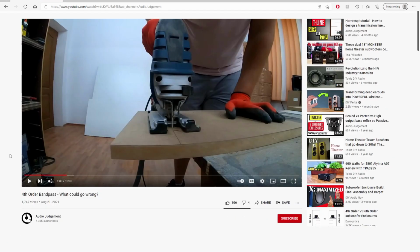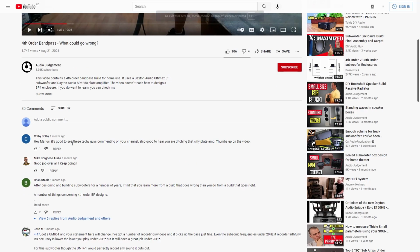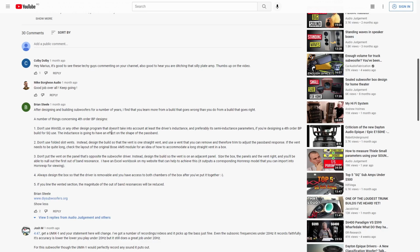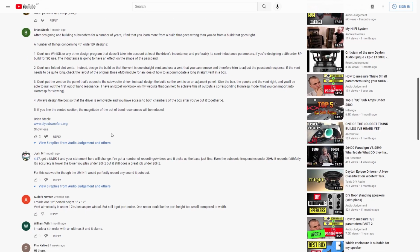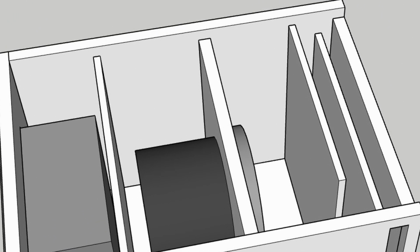Okay, good. But what am I going to do differently this time? Well, let's follow some ideas from the community. So nice to see that people are sharing tips and ideas so we can perform better at our craft. So I'm going to use some ideas that Brian from DIYsubwoofers.org has pointed out. First thing that needs to change is the folded port. The fact that there are too many 90 degree turns will create air turbulence and the port might be noisy.